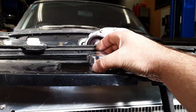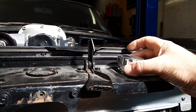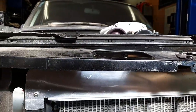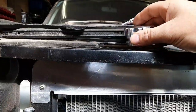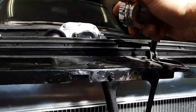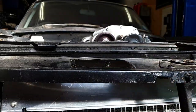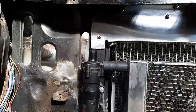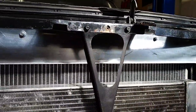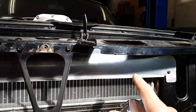Filler cap's going to go here. Probably we'll put the filler cap on the other side there and have the radiator overflow on that side. It would have been nicer - I'll freely admit - to have the radiator overflow on this side and the intercooler header tank on that side. But the tube from the radiator cap overflow actually comes out in this direction, and we've got the pump on that side - it'd be a nuisance to run a hose up and across, adding complexity. So intercooler header tank there, radiator overflow tank there.